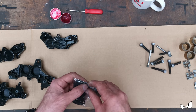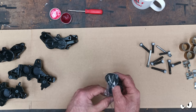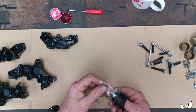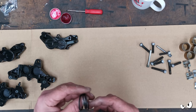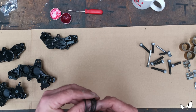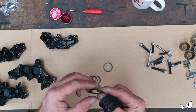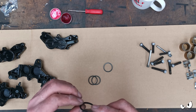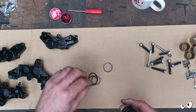I might even make some on the lathe out of stainless because that's about as easy as it gets to make, apart from maybe a washer. One of the springs is fine, the other one is kind of discoloured as well so we'll be getting replacement springs anyway. But for now these are perfectly serviceable. These are square seals - it doesn't matter which way around they go. Sometimes they're like a trapezium sort of shape, but these are square ones.